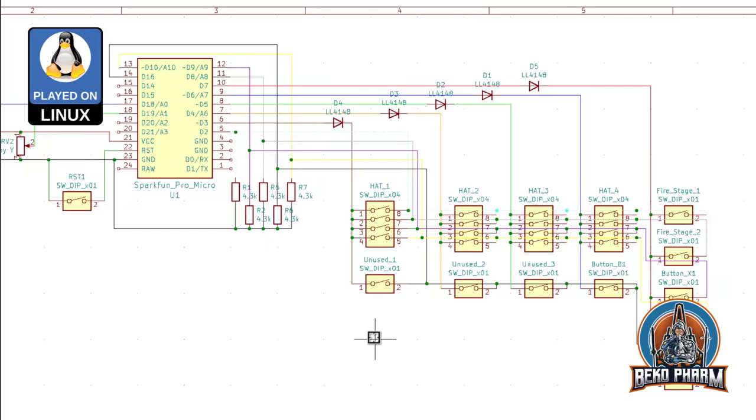Okay, this is a 5x5 button matrix. The way this works is like this. I have 5 output lines, and I have 5 input lines. The diodes are just to make sure I don't get any backflow when I'm reading the signals, and I'm not sure how the Arduino would behave if I feed some voltage back when the line is low again, so let's make sure this doesn't happen.